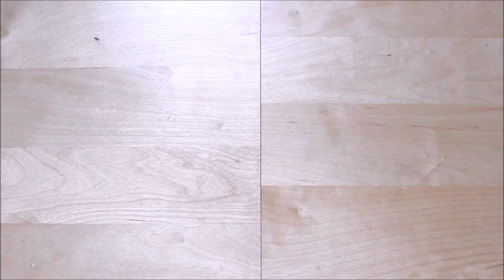So I'm going to show you the parts first so you can make your Newtonian mirror cooler, and here are the following. First off, you're going to need 3mm Perspex plastic sheeting. You can get these from a lot of DIY stores, and because this Newtonian mirror cooler can be used as a light shroud, use a dark colour Perspex plastic sheet like this, which is A3. Depending on the size of your mirror you may need to get bigger sheets.